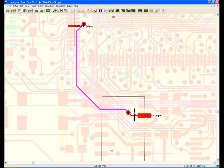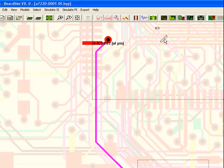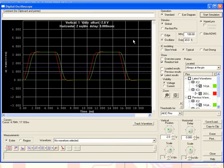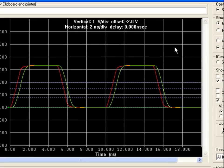However, having instigated the correct strategy, it's simply the resistor value which is wrong. We can calculate that inside the simulation tool — it should have been 68 ohms. Applying that to this particular design and re-simulating, we now have a perfectly terminated clock which will work. This could have been discovered before the first prototype was built by using simulation.